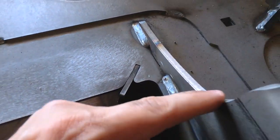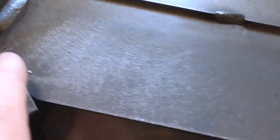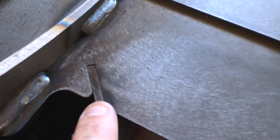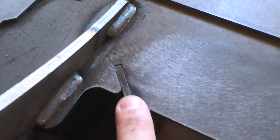Coming around the back, we can see the piece that gives reinforcement to the back of the deck — so if you hit anything, this has a ton of strength and rigidity. We tab things in to even the stresses out nicely here. When we tab stuff in like this, it adds mostly more precision, but also some strength to how the deck is put together.